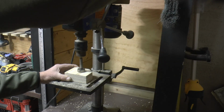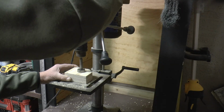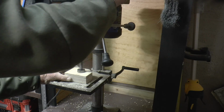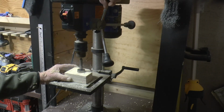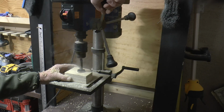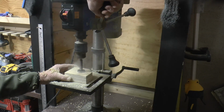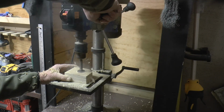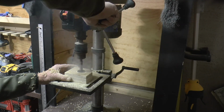Over to the drill press to hog out holes in the 2 outside fence pieces along with the 2 inner walls of the blade protection box. Now I'm only drilling 3/4 inch into each piece so that we can glue the dowels into place. Now if you're asking yourself why so much smoke, well, that's just me using a dull bit because that's all I could find in a 1.25 inch size.